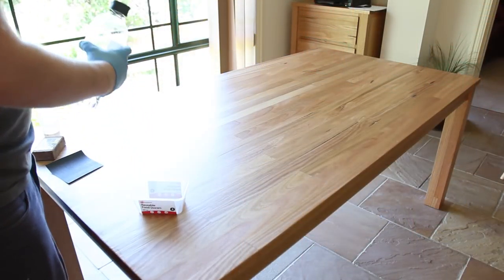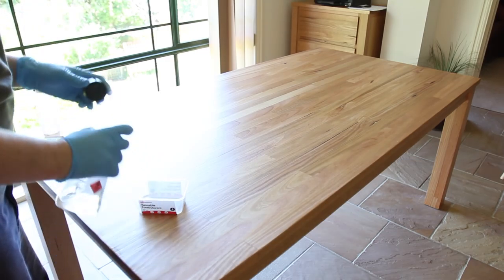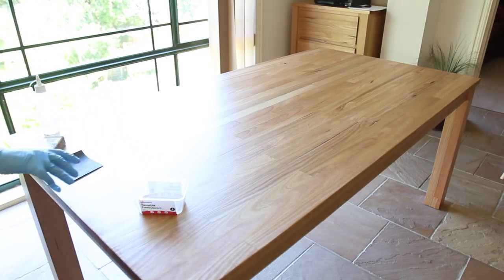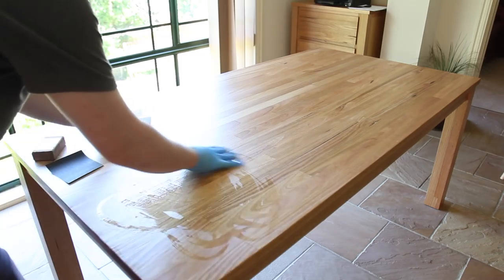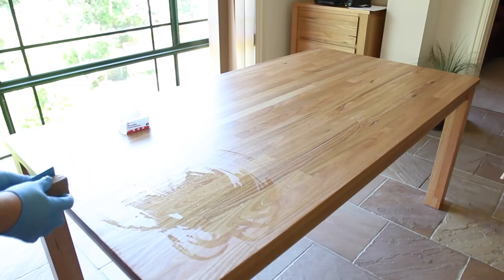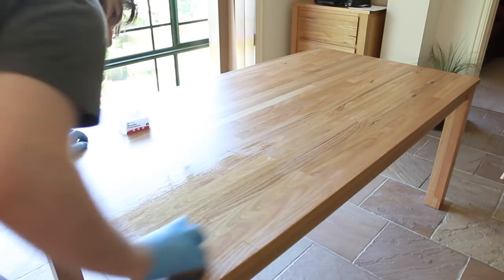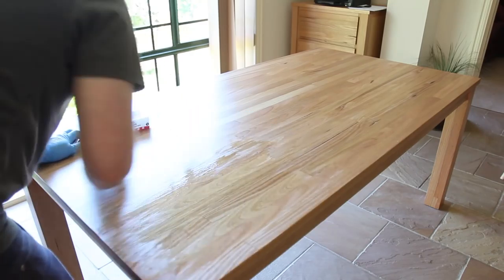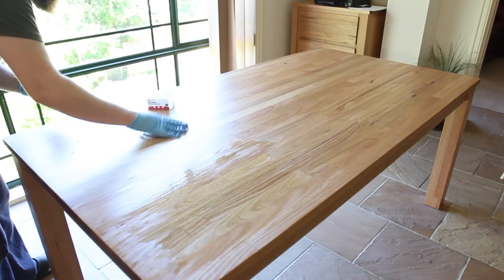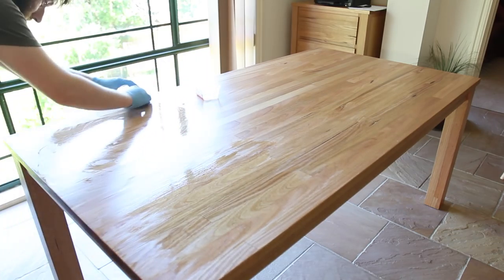After several coats and after the finish had cured for a few days, I wet sanded. This helps de-nib it, but the final buffing really takes the finish smoothness to the next level. This mixture I picked up from the Wood Whisperer — it's a small dash of mineral oil, about a teaspoon, and turps mixed together. Then using 1500 grit sandpaper — Mark uses a power sander, but as I don't have any sandpaper that fine that is also velcro-backed, a sanding block and some elbow grease did the job.